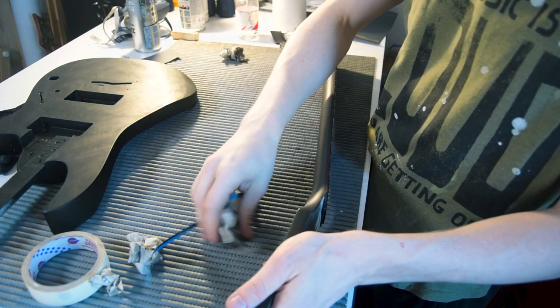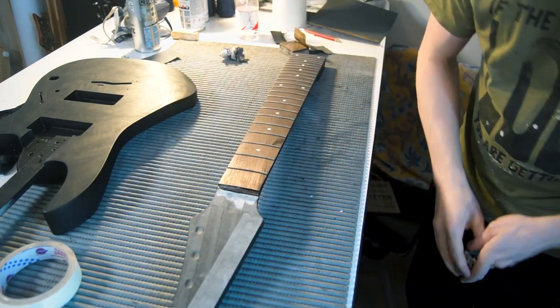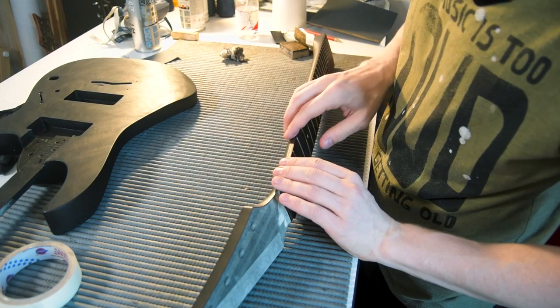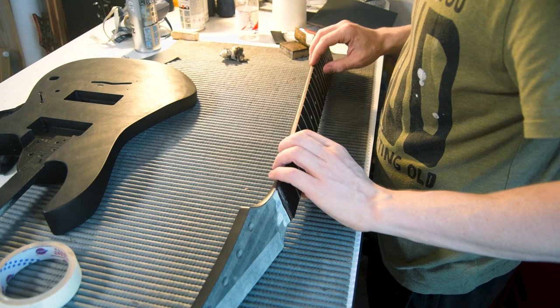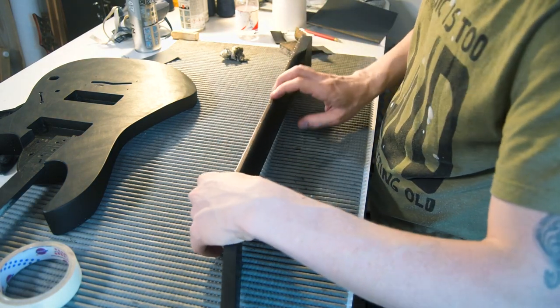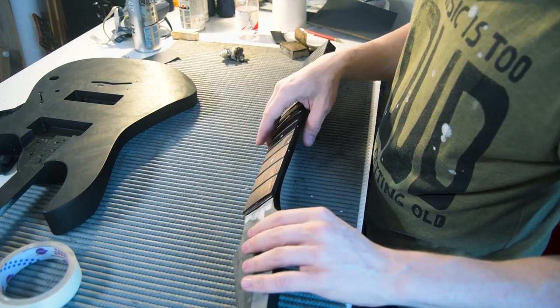There. Now, after taking off the masking tape, there is definitely gonna be an edge to the paint, and we're gonna address that with the scuff sanding. Basically we're just gonna bring that edge down a little bit so it's gonna feel smooth to the touch.